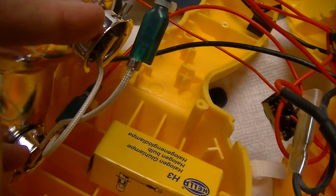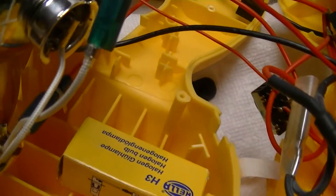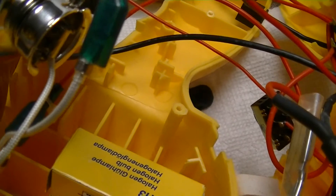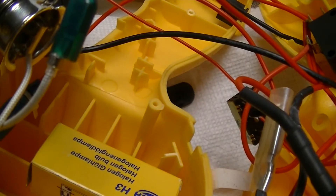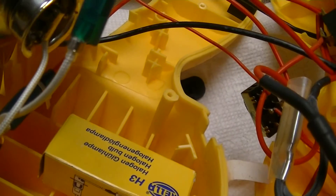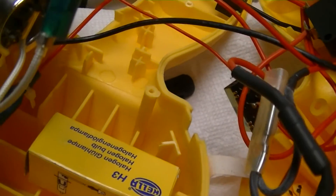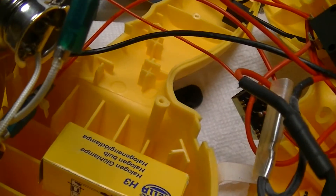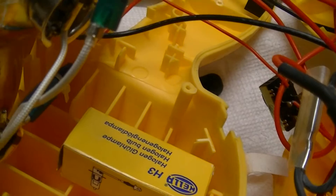What I'm going to do is replace the stock lamps, which are marked as being 12 volts, 100 watts. Based on some testing with a potential of about 4.4 volts across them, they draw about 3.3 amperes, which would suggest they're probably going to be on the order of at most 70 watt lamps — not the 100 watts as claimed.